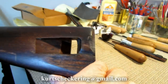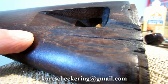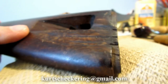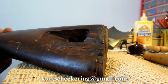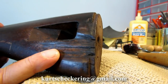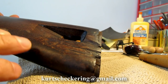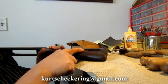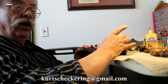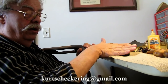Now we have something like this bad split — this is my practice stock for trying things on. This has a terrible deep gouge in it in a wavy, awkward pattern, and it's old. The old patina of weathered wood is over the gouge, so it happened a long time ago. It would have to be patched. You'd need to find a piece of wood that blends and matches, cut this out, smooth it as flat as possible without removing more than necessary, find a matching piece with the grain oriented correctly, and make sure both mating surfaces are perfectly flat.